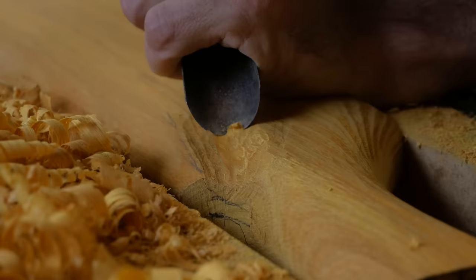Fine-tuning the transition with a chisel — I'm trying to put a little curve to the transition up towards the top of the stock on both sides, trying to make them similar and the same. You're obviously not going to get it perfect, and that's what's great about hand tool work — it's never going to be perfect, you can always tell it's done by hand, but you want to do the best you can.